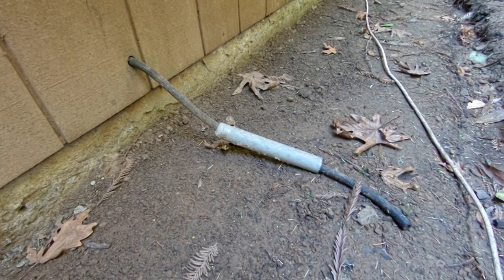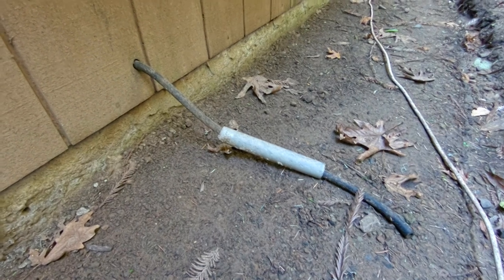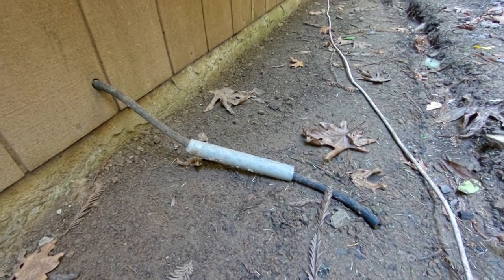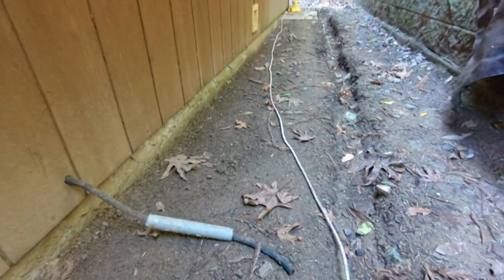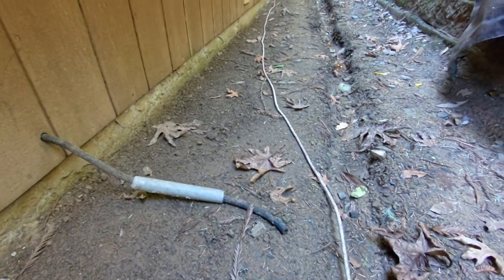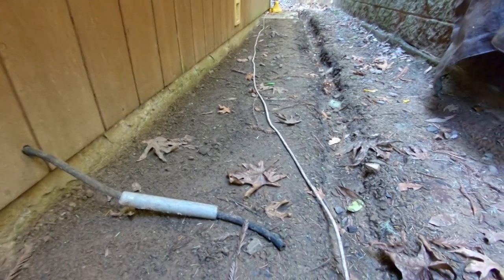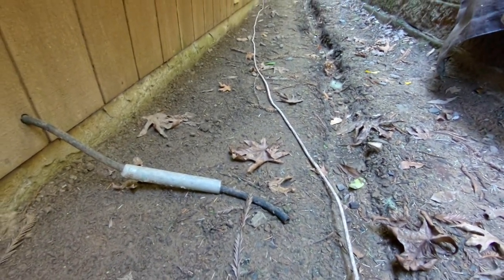Here's the hose where it comes out from the wall of the garage, and this is better than having to keep coming into the garage and emptying the water bucket. But this area is really damp and this is where there's supposed to be a French drain. Basically I don't want water dumping out here. The water was pooling up around the ground around the dehumidifier — so the dehumidifier was taking the water out of the air and putting it onto the floor. That's not ideal.